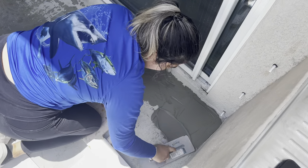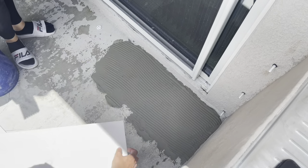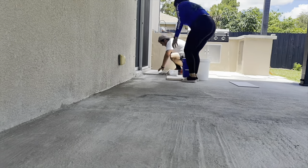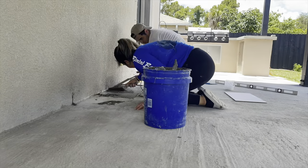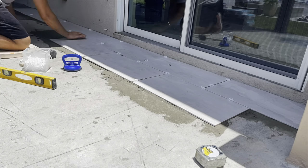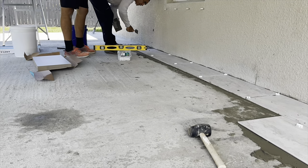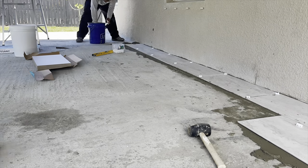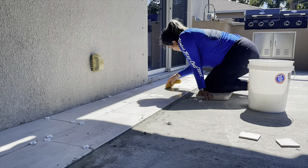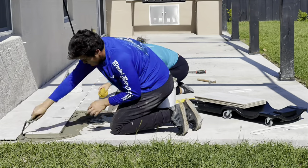To install the tile, add some mortar to the floor and spread it evenly using your trowel. Then, at an angle, go over the mortar to create grooves. Place the tile over the mortar and make sure to check for leveling. Using your initial tile as a guide, repeat the process: mortar, grooves, tile, and level. Place spacers between each tile and push the tile so the spacing is even across the entire floor. Clean any excess mortar as you go — this will make installing the grout at the end much easier. We recommend one person installing tile while someone else cleans the excess mortar with a wet sponge.